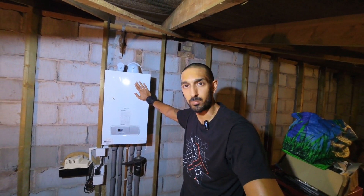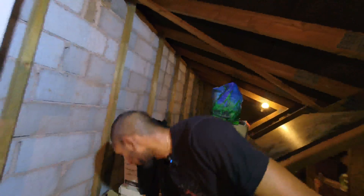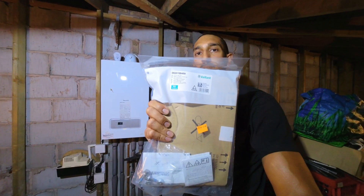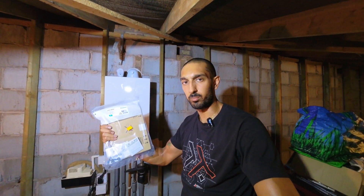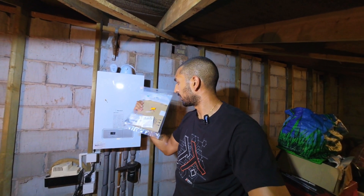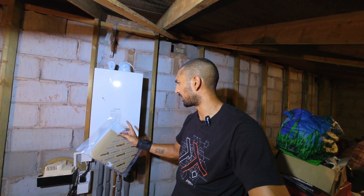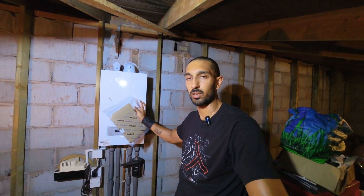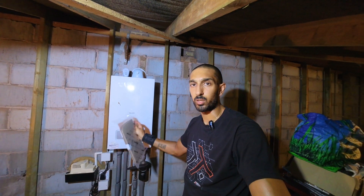These boilers are exactly the same as servicing a Vaillant Ecofit Pure or a Heatline Caprice. The burner gasket I've got here — I'll put the part number in the description. This is a Vaillant one; it's the exact same one as the Glowworm one. It comes with two seals: a graphite seal and a neoprene seal for the burner. This boiler is about six or seven years old so it's due a full service — get the case off, strip it down, clean the main heat exchanger, change the seals, do my 269 checks.